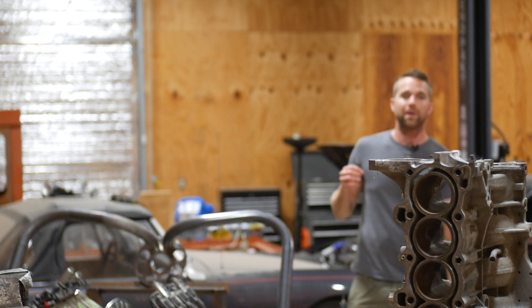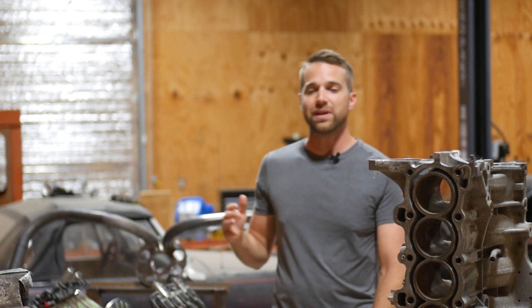In this video, we're going to be talking about engine tuning. Every engine that uses a fuel injection system typically has two tables that really drive or create the performance of how that engine runs. Those two tables are your fueling table and then your ignition table.